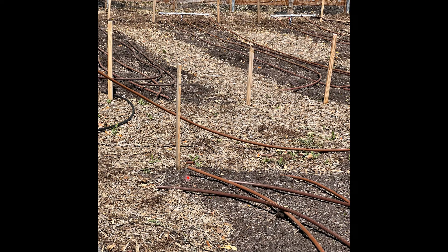You see here are the ends — we just have to close them. Now you see this little tiny piece: when I stretched the drip line there happened to be an emitter at the very end. You don't want an emitter at the very end because then you're watering the mulch in the alleyway. Since these are one foot apart, I cut that extra piece so the last emitter is not at the very end but at least six inches from the edge — in my case it is one foot.